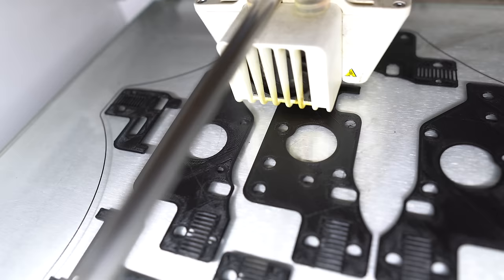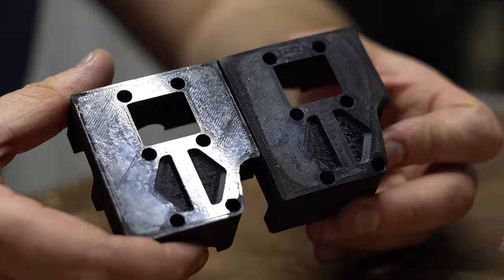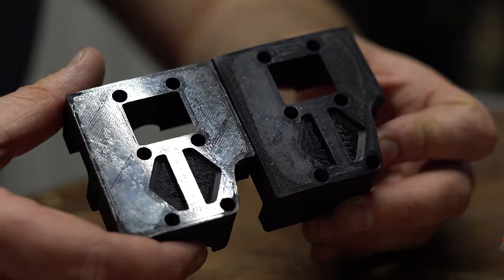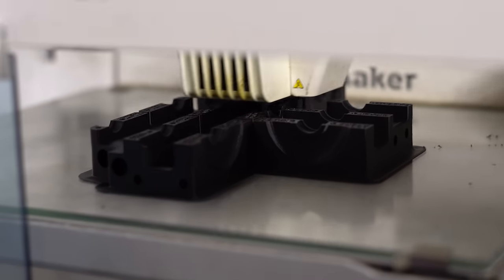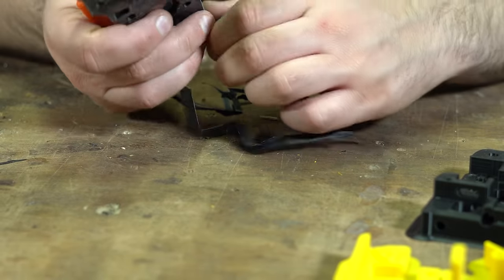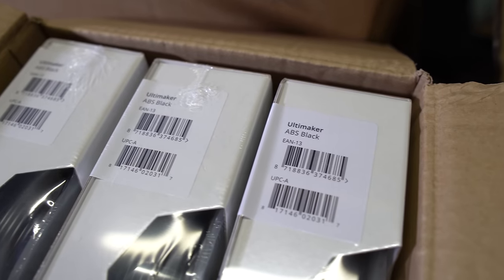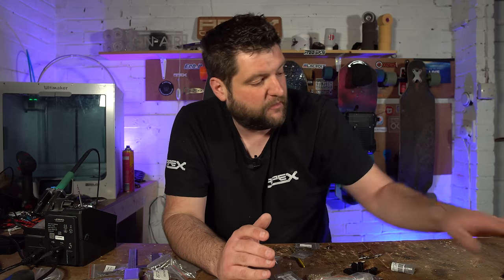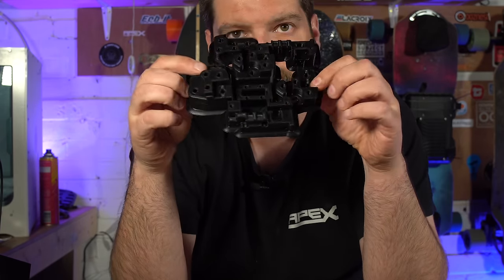Also, when I was looking at the printed parts so far, I noticed that a lot of the parts had slightly warped on the corners. You can see here in this video two parts, one with warped corners. What I've done is reprint any of the bits that I think are crucial, and I've used a brim. The actual Voron instructions don't tell you to use a brim, and I didn't use a brim for any of them, but for the large flat parts, definitely, in my experience, if you've got a filament that is susceptible to warping like I have, the Ultimaker ABS seems to warp quite a bit, then it's worth using a brim. So I've reprinted a load of the gantry parts with a brim. I've got these bits and some other bits as well, and we'll see if we use those.